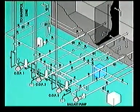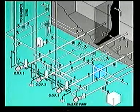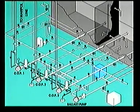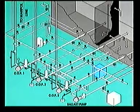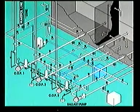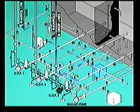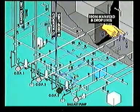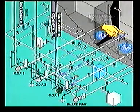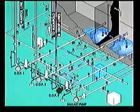Filling the slop tanks with water is actually the first part of the tank cleaning. While you do this, you can also clean all your cargo pumps, deck lines, and the manifold pipes. Let each pump take water from the sea. Circulate it through the manifold, back to the pump room, and the port slop tank through the MARPOL line. Next, circulate water through the drop lines, back to the crossovers in the pump room and to the slop tanks.